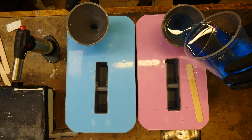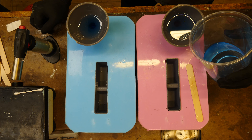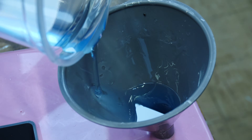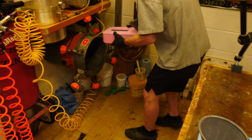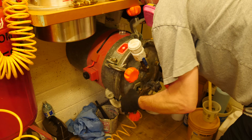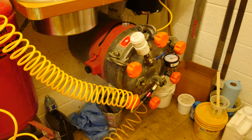Great to see the bubbles explode up that close — beautiful degassing montage. Everything is gravity-fed on these molds, so we tip the molds. We pour into the low spot and allow the air to escape through the high points of the mold out of the vent holes. We know the mold is filled when we see resin coming out of the vents. Into the pressure tank it goes — we do two at a time and cure them under heat and pressure for about five to six hours, then we can demold them.